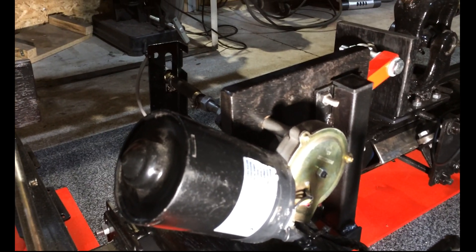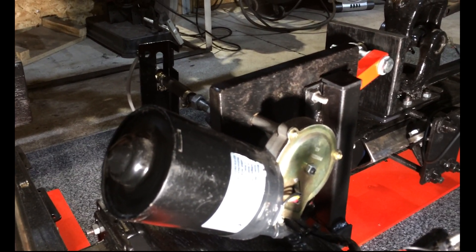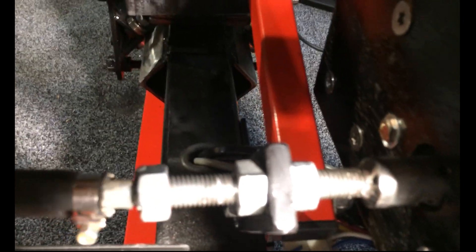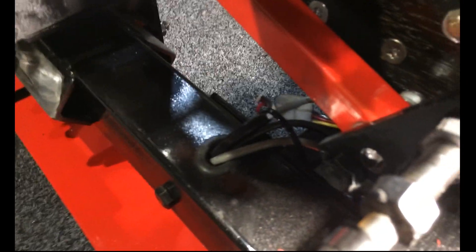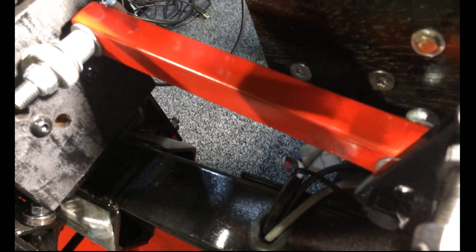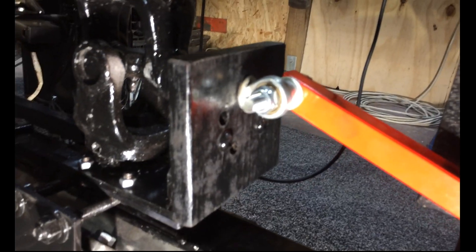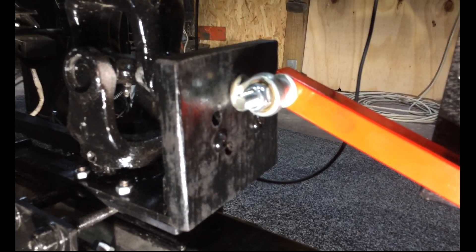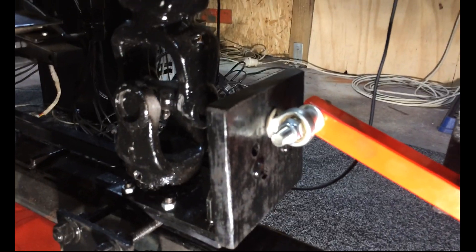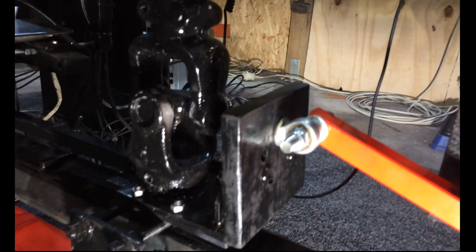Same with the new surge axis motor here — you can see it's on timber. Anything associated with that motor: its lever — where the shaft comes out with that 12mm rod — connects to the lever, which in turn connects to a 25mm by 25mm box section that pushes the uni-joint trolley rail carriage. That carriage is attached again to some hardwood via a tie rod. So everything with the motor and everything associated with the motor is isolated via the Merbau timber bracketing.